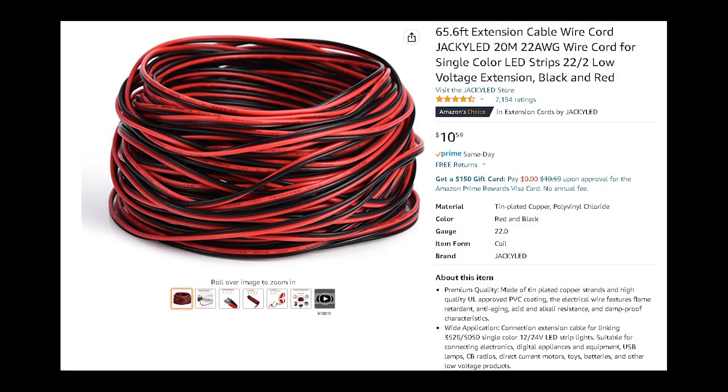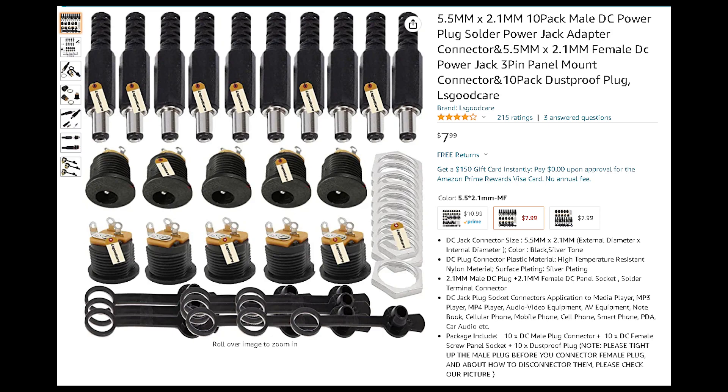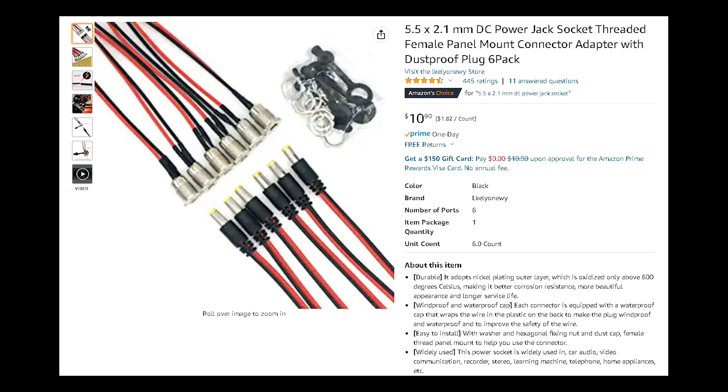We have included a link to some wire, but because it's low voltage and low amperage, you don't need anything fancy — but when in doubt, use something that's recommended. For this project, it's 12 volts and 5 amps, and that's going to be pretty easy to cover. Unfortunately, the hard part is the ports and jacks. We have an easy way lined up, but we would say these are for more advanced users, as it can be hard to identify where the positive and negatives are supposed to go. We'll be covering that in our soldering video, but for first timers, we recommend pigtails that are the same size plug and jack but have the wires already attached, so no soldering required.